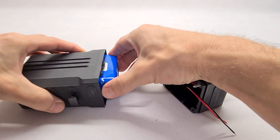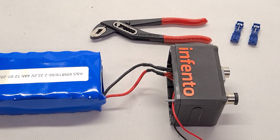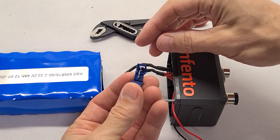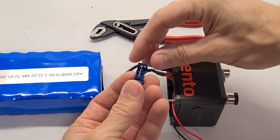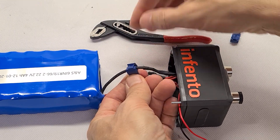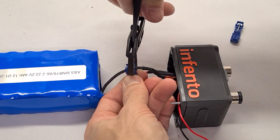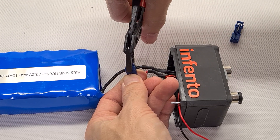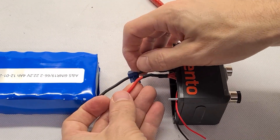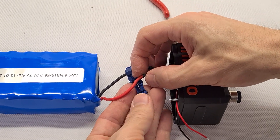The next step is easier if we pull the battery entirely out of the plastic casing. We now have to crimp one T-crimp terminal into each of the red and black wires. It doesn't really matter which of these cables you choose, as long as it is one red and one black. I found the thick cables more suitable, at a location 3–4 cm (about 1.5 inches) away from the battery cells. The crimp terminal cuts into the insulation when the clamp is closed with the pliers.